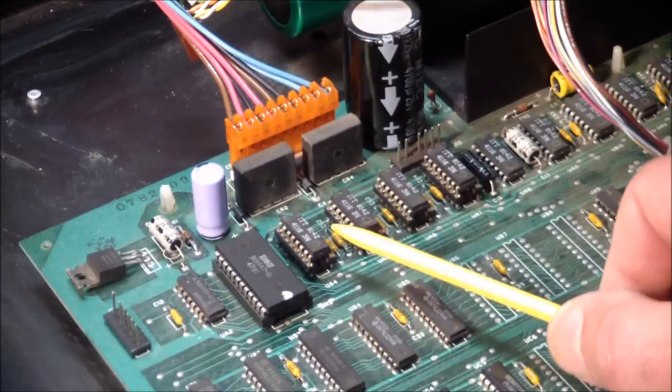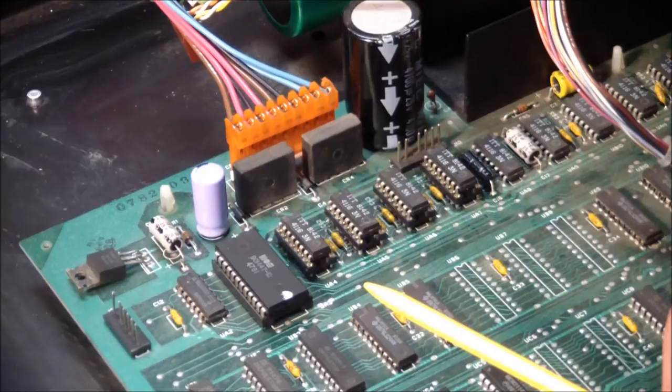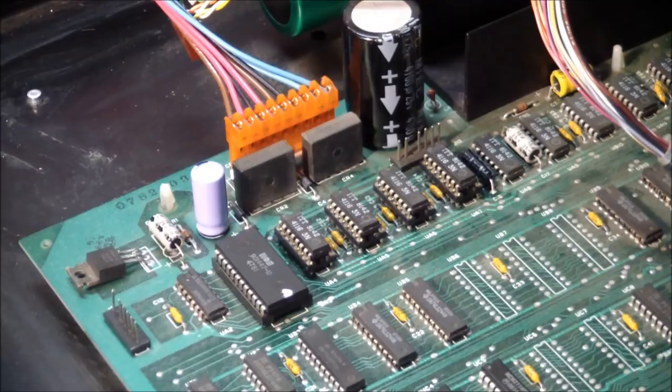I used my trusty DRAM tester, which is my parts TRS-80 Model 3. It has no disk drives or anything in it. You pull one of the 4116s out of the Model 3 in the first bank of RAM, and you put the test one in there. It'll either boot up telling you that the chip you just put in is good, or it'll show garbage on the screen, which will tell you that the chip's bad. It's very reliable, hasn't failed me yet.